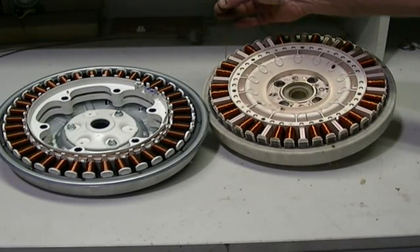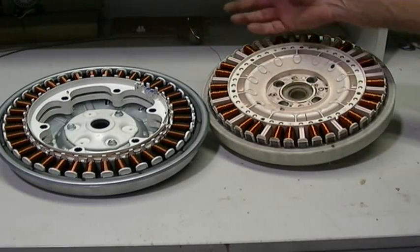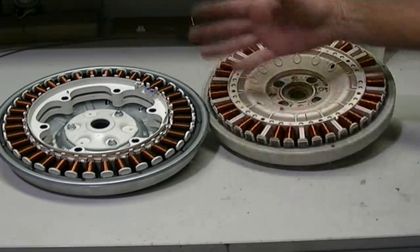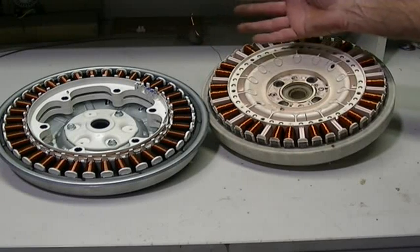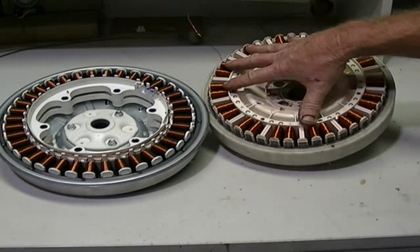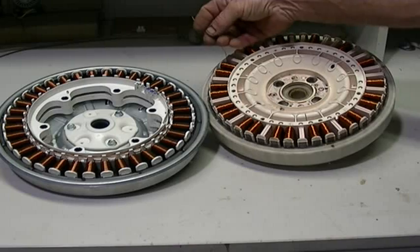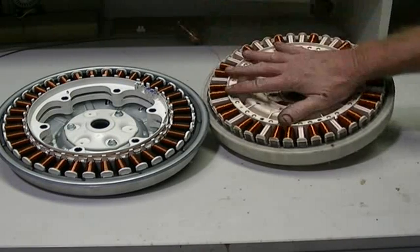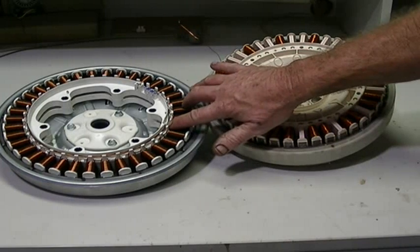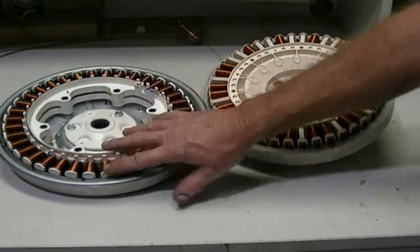That simply means the size of the wire they use and the voltage the motor ran on. So the 100 series had 1mm wire - it was a low voltage motor. And so on down through the series till you got to the 40 series which was 0.4mm wire and a lot higher voltage. This one here looks like an old 60 series with 0.6mm wire, and this one here looks like it's got about 0.8mm wire on it, which is better for us.